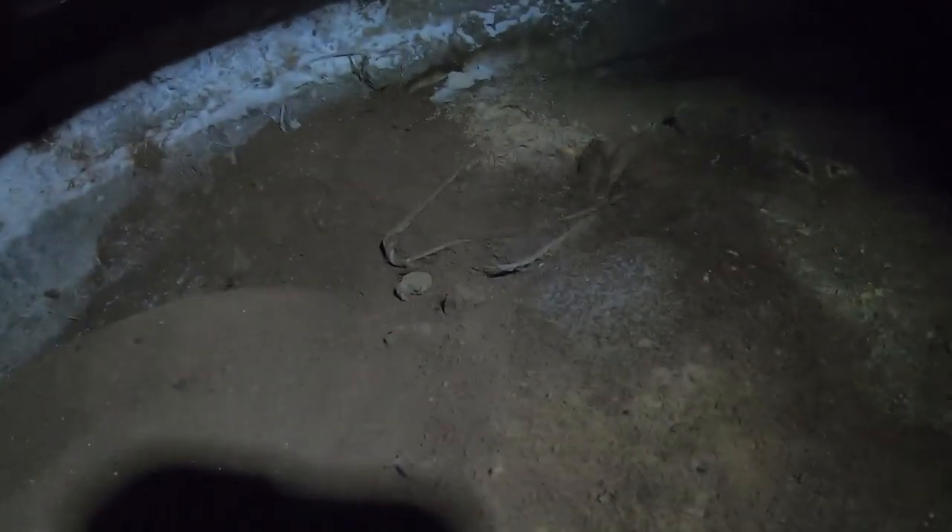My customer wanted to keep one of the old floor heaters as an emergency backup in case she ever needed heat with no power — not a bad idea. But it was very tight squeezing between the foundation wall and the floor heater, so I didn't take the camera over there. Now I'm working my way back with the Romex wire, putting Romex staples on it and stapling it to the floor joists to get it up and out of the way. It got a little scary — there were water bugs and some weird bugs that looked like centipedes.